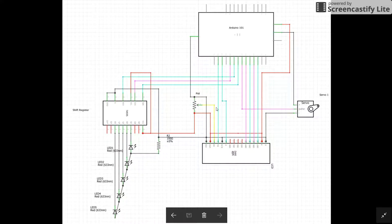This is the potentiometer which connects to the LCD screen. Over here on the shift register we have all five LEDs connected to the ground through the resistor. On this LCD screen we have the same wiring — all the grounds, same pins. Over here we have the servo which is getting voltage from the five volts and gets grounded through everything else.